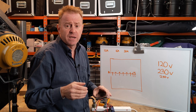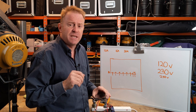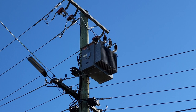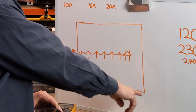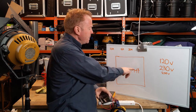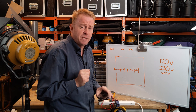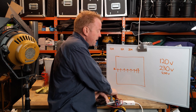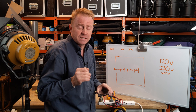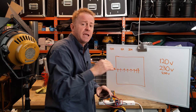So far we've done all our calculations based on nominal voltage. If you're working in inner suburbia, that's probably fine 95% of the time. But one thing that can really affect your voltage is how close or far away you are from a power transformer. If you're working out in the country — say, hundreds of metres or even a kilometre from the grid — here's a trap: you can plug your meter into a power outlet and the voltage seems fine. But the voltage will drop tremendously as soon as you put load on. As soon as you start running lights, you get more resistance along the cables and your voltage can drop sharply.